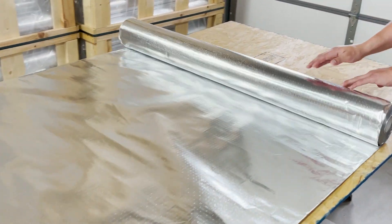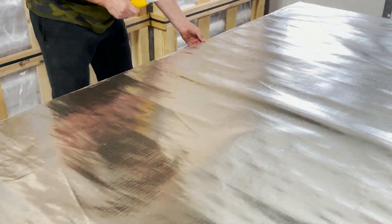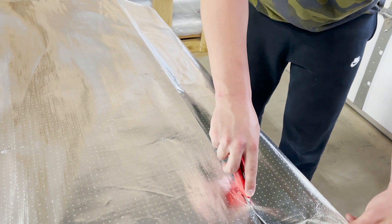Just use the 48-inch product, and you can use either the double-sided attic foil or the single-sided attic foil. If you use a single-sided, make sure the foil faces up toward the airspace — it cannot be in contact with the OSB. Once you get it rolled out, simply use a hammer staple or a staple gun. Staple around the edges, put a few staples in the middle of the field, and then all you've got to do is come along and trim off the end.